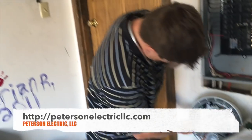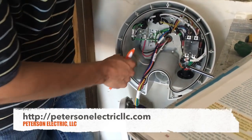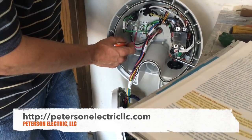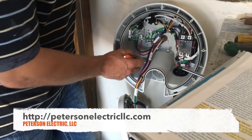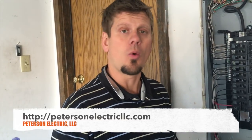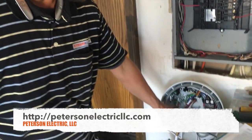With this right here, this is actually three wire. Here's our grounding, here's our neutral which we don't need, but I'm not going to put a 10-2 on this truck all the time — it takes up space. I always use a 10-3 typically. Sometimes baseboard heaters will be a 10-2 and a hot water heater 10-2, but motors are 10-3. If you deal with hot tubs, they're typically a 10-3 unless it's Sundance. We do cooktops, drop-in induction, and small wall ovens — they're all 10 gauge 10-3 as well. So I typically just cap my white because I don't want two different types on my truck, and then I go ahead and land it up here.